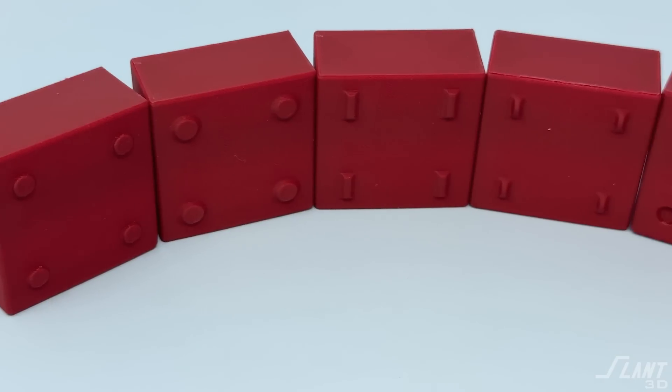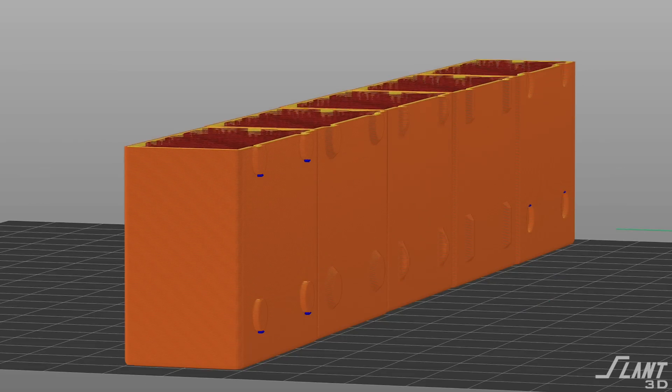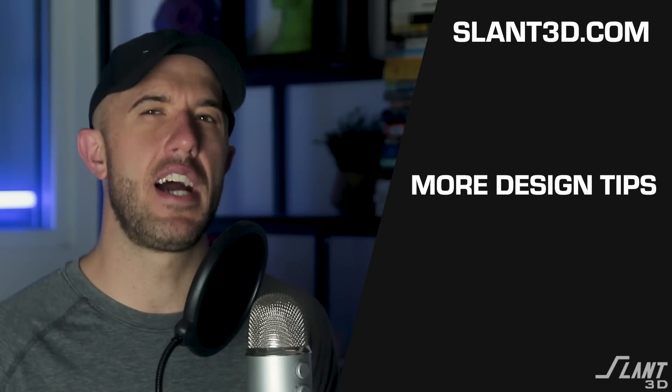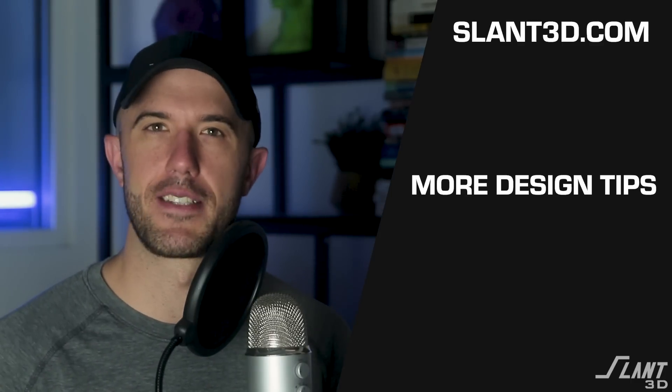Hopefully this covers all the ways of making feet for any sort of given product. They're a very small feature but very often designed incorrectly — people just extrude them out the side and don't even apply something as simple as a chamfer to make sure they don't turn into an overhang. The more fundamental thing people miss is that if you put feet on the bottom of the part, you cannot print that part feet-down on the bed — you have to print it on its side or diagonally. Check out those videos if you want to learn more, and do suggest any other features you'd like us to discuss for mass-producing a reliable, high-quality 3D printed product. Have a great day!